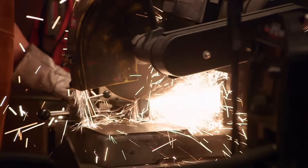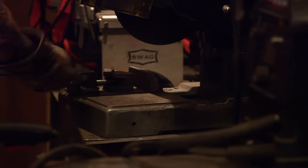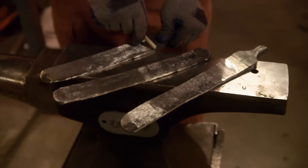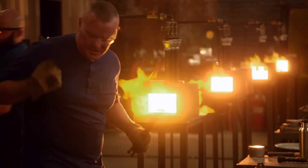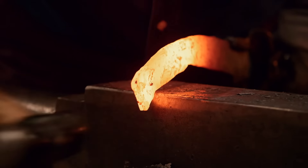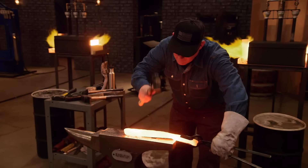So I decided to go to the forge to heat this retention nut and see if I can hammer it off, and that's not working out for me. I finally decided, instead of using the big billet, to take it over to the chop saw and cut off small pieces. I got my W1 pretty much drawn out faster than I've ever done it. My goal at this point is to get them all tack welded together, stacked up, and ready to go in the forge. I haven't made a blade shape like this. The example has a very clear definition between where the blade ends and the handle starts — I need to bring that bulbous tip, so I'm just going to get it as close as possible.